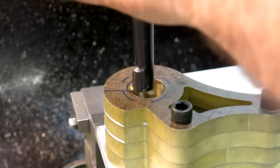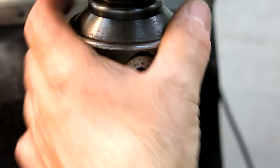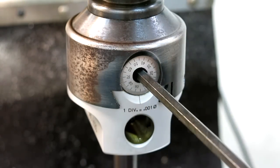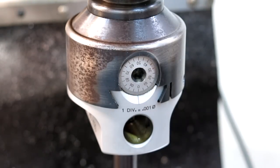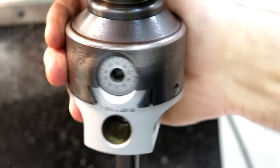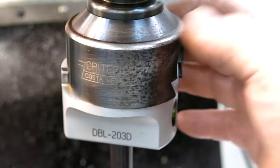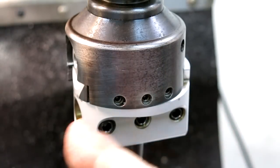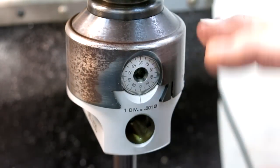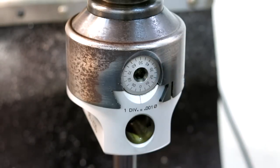I also know that I'm going to be bigger than that too. There's some controversy on whether you lock the locking screws or not. The way I do it is I leave some tension on these and I don't mess with them ever. Once you have a tension where you can move the head around, I just leave it — I don't lock and unlock it. Things move around when you do that; this way it's kind of steady state, you can move it around and it's predictable, and that's what you're looking for. Alright, let's make a cut.